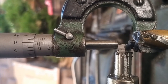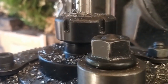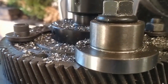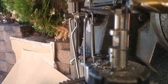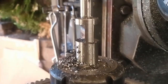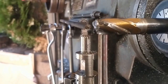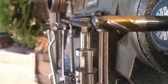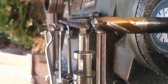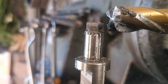Okay, not bad. So before I pull the collet chuck off the rotary table and take it over to the lathe to part the thing off, I'm going to make up a hexagonal electrode while I've got my numbers set up here, and that way we can make the little spanner arm for this hexagonal flat to operate the spreader bar.